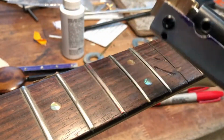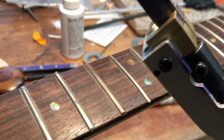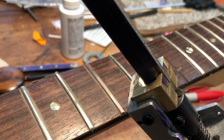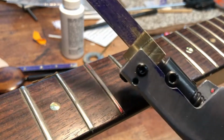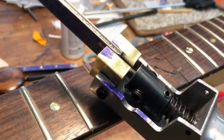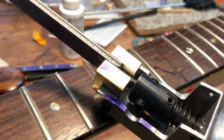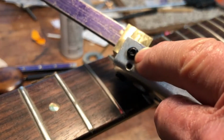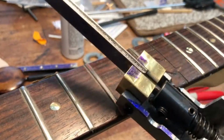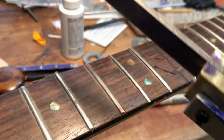And this, I'm happy with this. That block just pops right out of there. How long did it take you to do that block? Because I've done it a couple times. See how it has a little recessed hole in it? I needed that earlier because sometimes the file where I cut it down would hit the block. So it's been back and forth in the mill a few times. First you have to square it up and then slot it. Next I won't need that. I'm just going to slot it. It's much easier to make now. Drill a couple of holes through the side of this right into the block and tap. Have a clearance hole in that and tap the block. Same on the bottom. So the block's held in tight by 3 screws. Man, that's uptown. I love it.